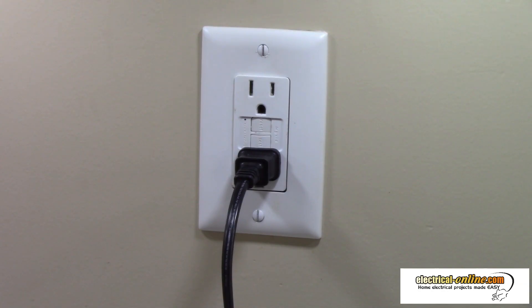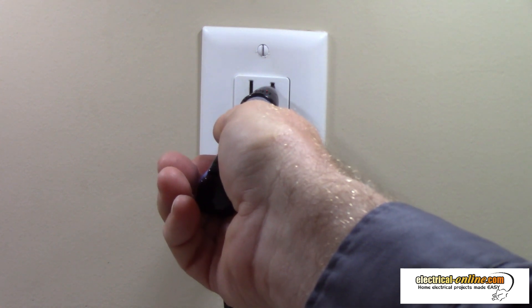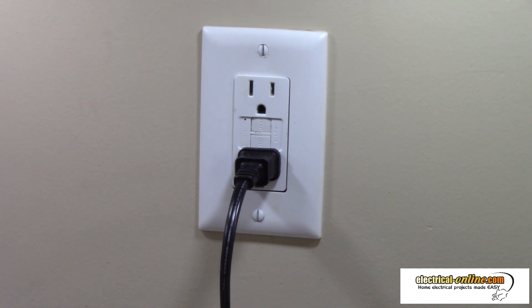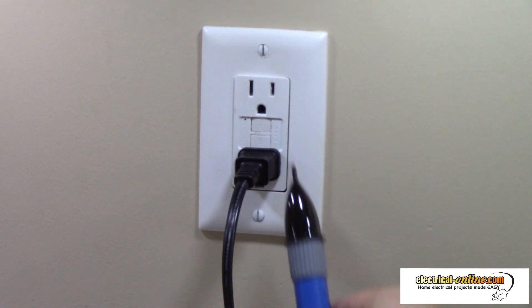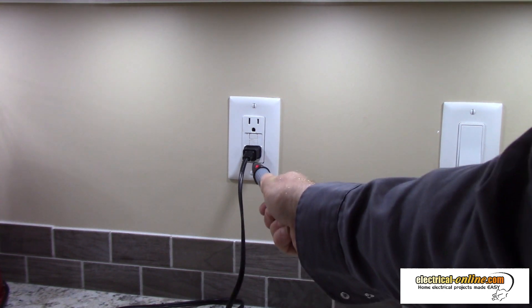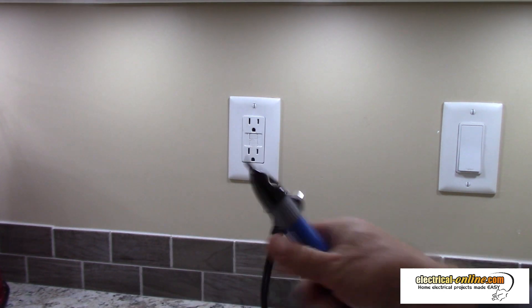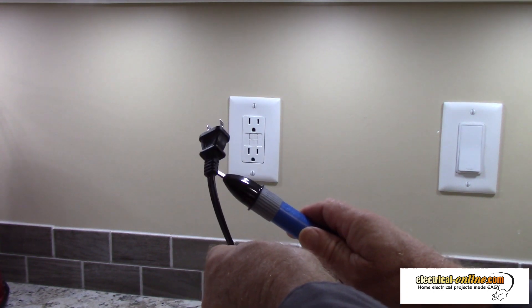Let's show you how these are generally used to check for voltage. To demonstrate how this most basic of devices is used, you simply go up to an outlet and touch it into the hot probe — touch it against the plug on the hot side. Follow that cable down and you can tell there's power in that line. It even works on the neutral side, so like I said, a little too sensitive, but get it away from the power and it quits chirping. With the cord plugged in you check along the cord and you've got voltage; unplug it and check again — nothing, just a little peep from static.